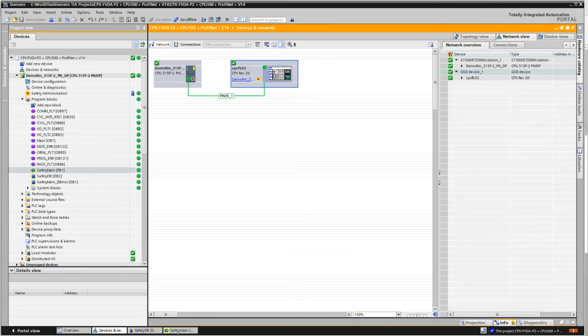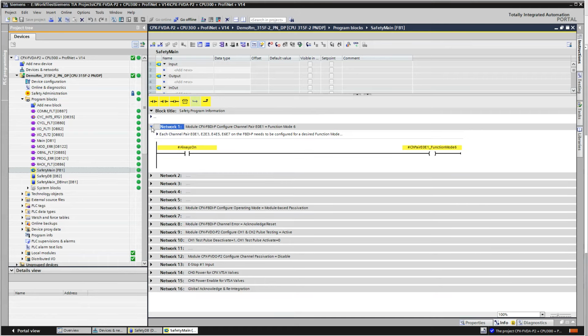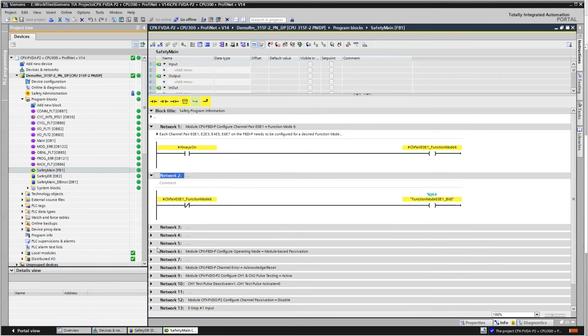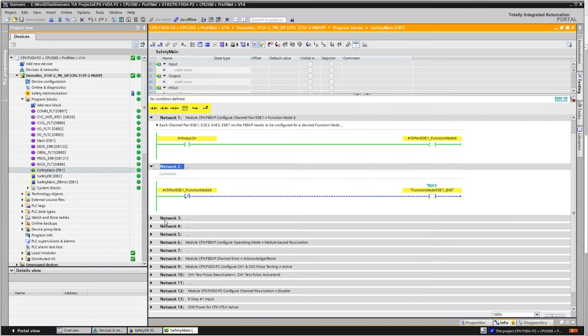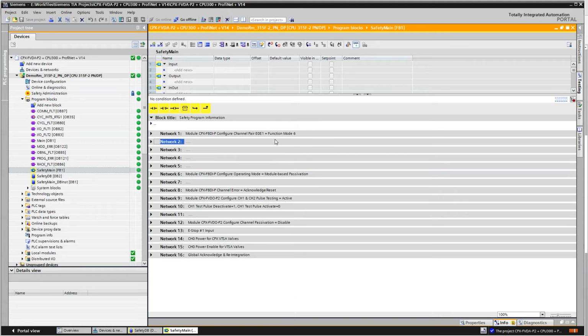Everything's good. Okay, so let's show some things in action here. Go into a monitoring mode here. So this is on. Because this is configuration data, and because we've just downloaded this for the first time, at this point, I'm going to cycle power to the CPX manifold entirely. The logic voltage and the load voltage. So the CPX manifold's off right now.